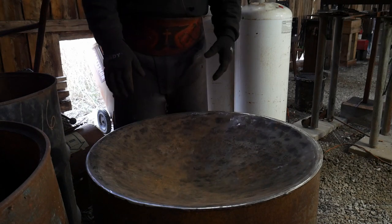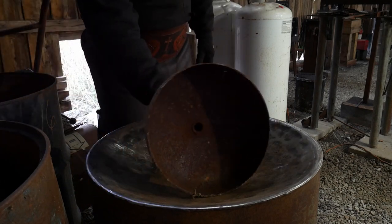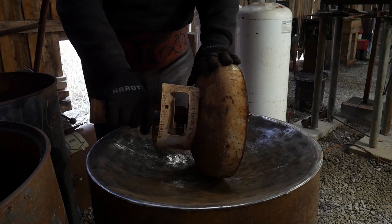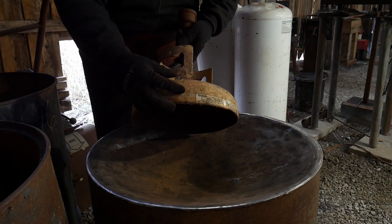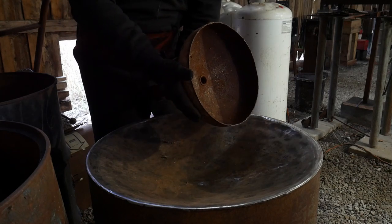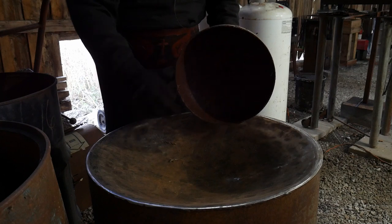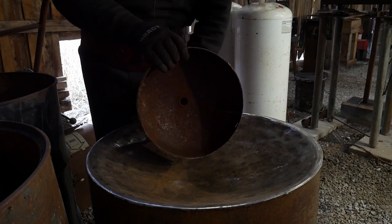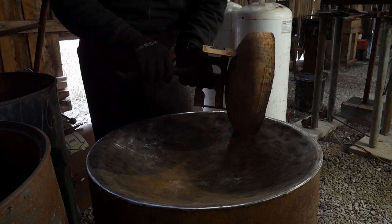Another swedge block alternative I haven't discussed yet is the top of a propane bottle — it's got a nice curvature in the bottom. I suggest not too tall a ring around it, maybe just a little bit up and then flare it out, and you're instantly into swedge block territory. Just set that in a piece of pipe and weld it up, or bend a thick piece of flat stock around it and weld it up, and you'll instantly have a swedge block. That's just a piece off the top of a propane tank — pretty simple.